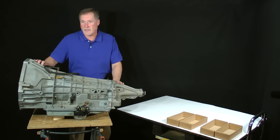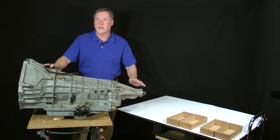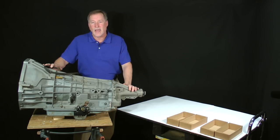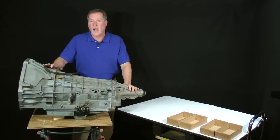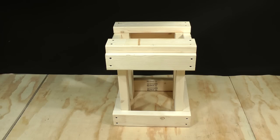Moving on, I have a few suggestions about an ideal work area arrangement which will help you work comfortably, orderly, and safely. Consider copying this layout. I have the transmission for disassembly on one bench — make sure it is sturdy enough to handle the weight of this unusually large machine. I use another 2½ by 4-foot bench for placing parts and sub-assemblies on as I remove them from the case. I place white poster board on it to make it easier to clearly see the parts. I will also use a homemade wooden stand to support the case in an upright position, and I'll show you how to easily make it from 2x4's later.